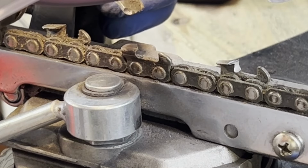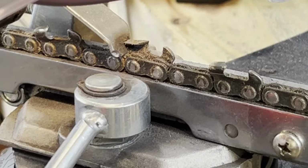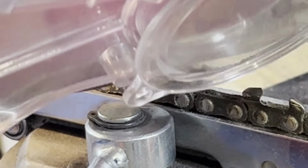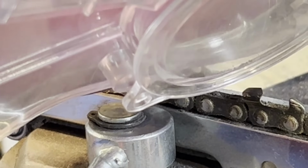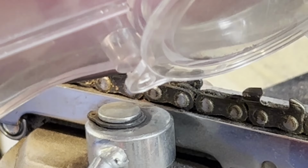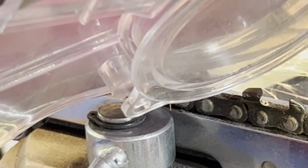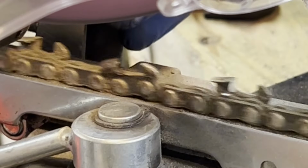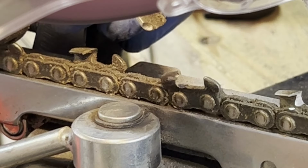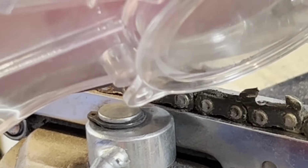I just let it hone on there until it pretty much stops sparking. It's kind of a variation. Do the bump cut so it stays cool. Make sure the depth's not too low, and just let it sit on there for a bit, hone it. See, that's just barely hot. It's a little bit hot, depending. So, same story. I just have to do this to all of them.